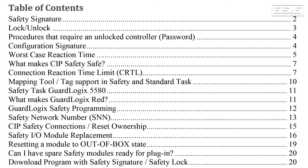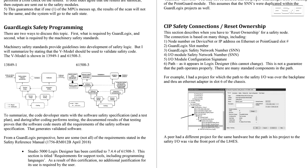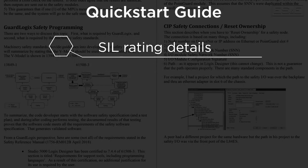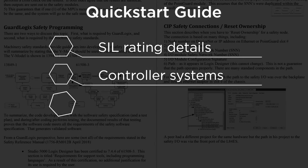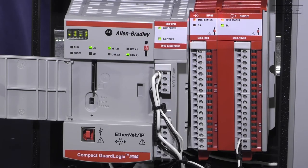The second advantage is the GuardLogix quick start guide, which is more specific and detailed for the exact programming and safety controller configuration requirements. The guide runs through the details of the SIL ratings, controller system, IO setup, and everything else that is necessary for an application development. Anytime you are not sure why a safety application used a specific code set, you can look at the quick start guide to explain specific requirements of the configuration and code. Also, for a person just getting started with a safety controller, having this reference material may be crucial for their development and understanding of the system.